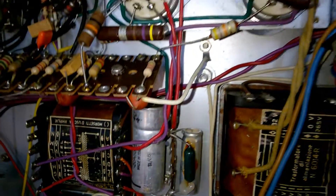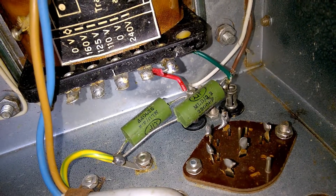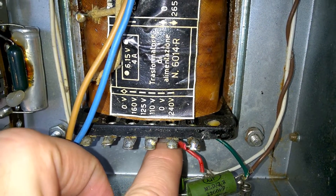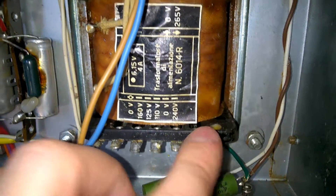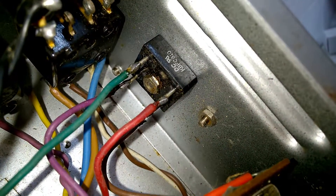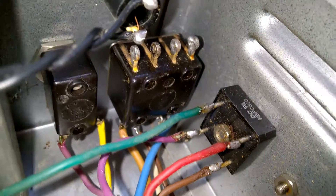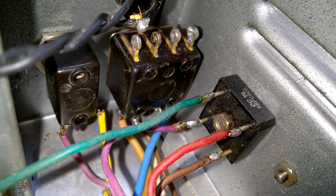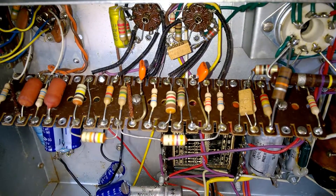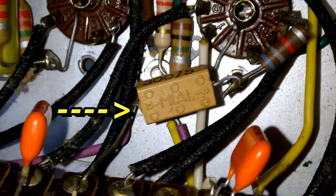This part here is without any function — oh my goodness, why? Anyway, you can still wire it up as needed. It is wired for 240 volts, which is correct. There's a little full wave rectifier, and another one — this one is not original of course. The AC mains power switch — yeah, they start to fail after a while, and you can clearly see someone already desoldered the wires underneath. The power output tubes area has lots and lots of old resistors — quite nice.